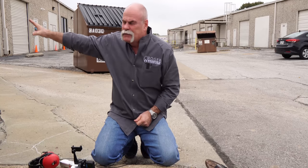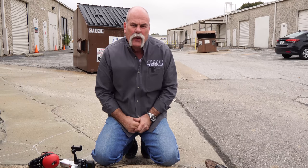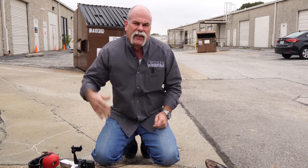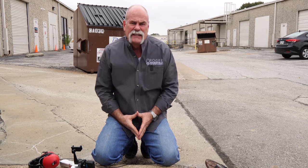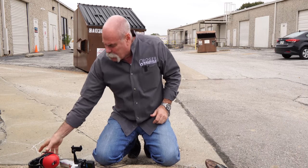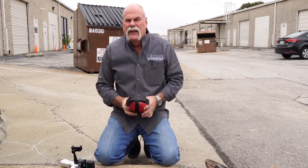Just because there's a water puddle in the house doesn't mean that there's a slab leak under it or that it's on the water system. If you see a slow turn, check nearby — see if there's a double check assembly, or anything tying to the irrigation system that you could possibly valve off. You would rather find for the customer a leak out in the yard or on the irrigation system, so they don't have to go through the whole leak detection process or a slab leak.